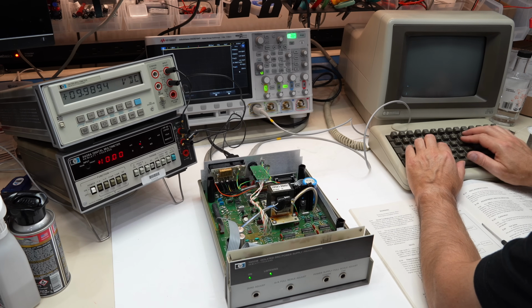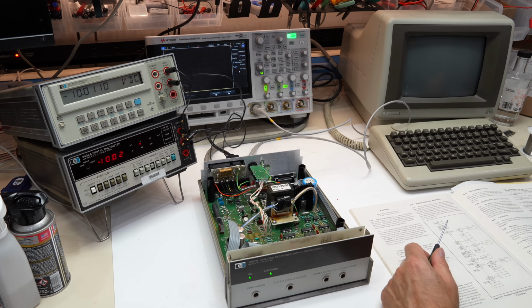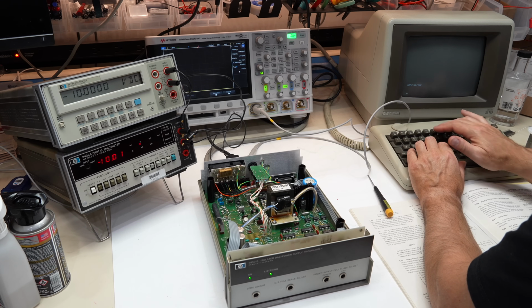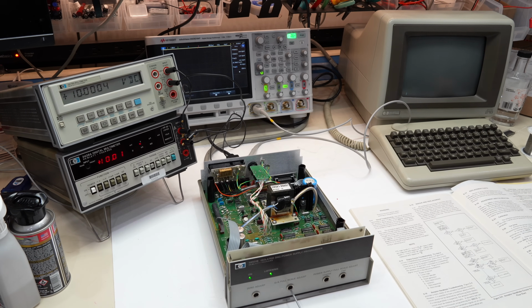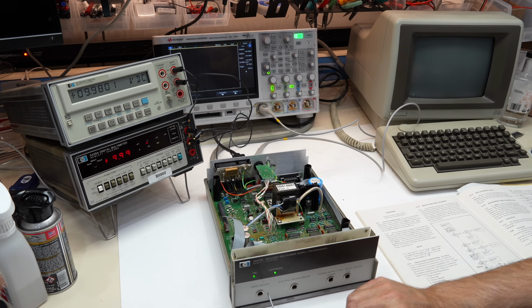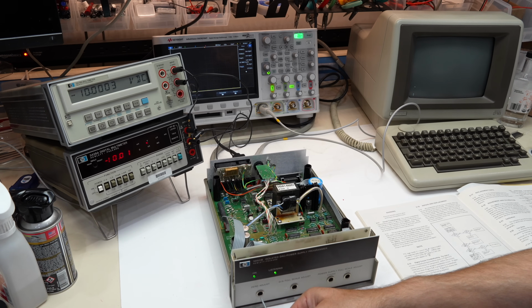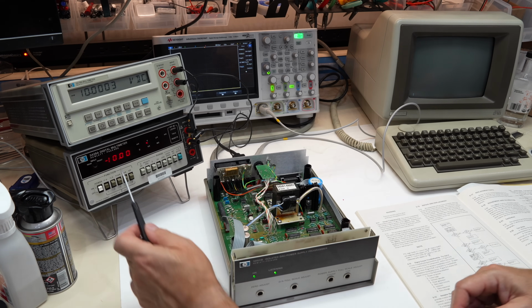Okay. Bipolar is adjusted differently. You adjust the negative endpoint. So I'm going to be at -10 plus 1 millivolt. No, it's not in spec. Okay, -10. And the other end of the spec, the top end is 9.98 because you have lost 1 bit of resolution. With my hard to turn pot, I don't like this pot. There you go, 9.98. But it's going to change when I do the other end. Anyway, it's 10.003. Okay, so we are totally within spec, right?